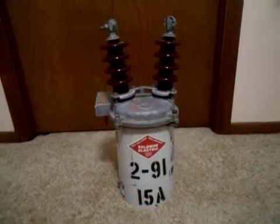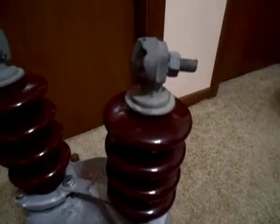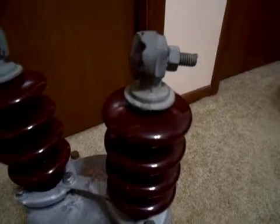The last thing you want to do is reset this thing into a dead short. These things are not supposed to explode if you do that, but there's always a pretty good chance it would. If you look right there, you can see marks in the glaze that are actually from arcs. It got so hot it actually melted the glaze slightly, and most likely that's why this was taken out of service.